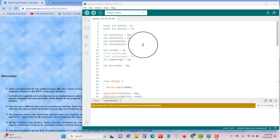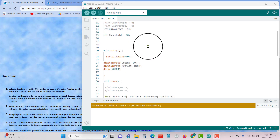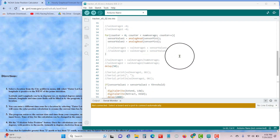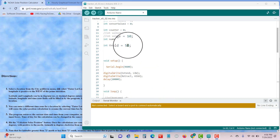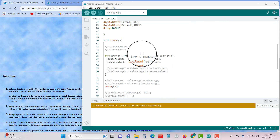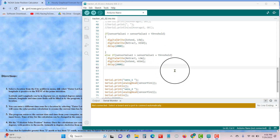The LDR sensors are broken up by a light blocker — one LDR is on one side of the blocker, so one is getting shade throughout the day and the other is getting more sun. As the sun moves overhead, that changes over time. It's taking sensor readings from those LDRs. It's very simple — I could be doing value averages and things like that, but I found that using a delay and a threshold set to 50 works fine. When the LDR sensors are more than 50 apart, it moves the actuator one way or the other.